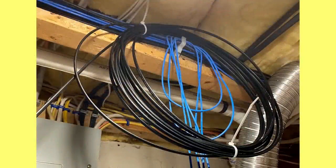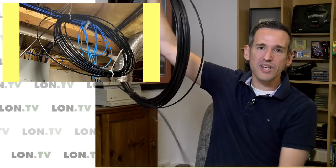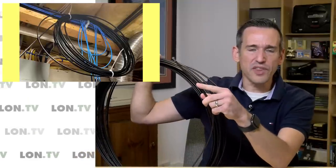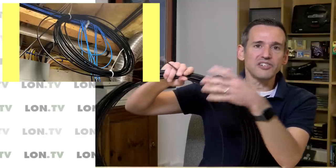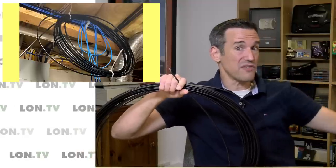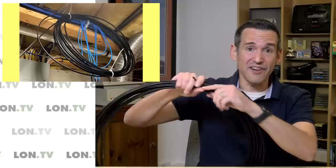After all that was over we got a nice big cable brought into the house. This one's a little different than the one they put out on the street because they don't need as many fibers here — again I'm only using two inside the house. So they ran a six-strand cable, so it's a little flatter and easier for them to work with. They said the most challenging part is not the fiber pole but getting it into the house. For me it was fortunate they just had to run it to the basement — a very short run — and they were able to get the cable in without breaking any fibers, because if you bend this stuff it breaks.